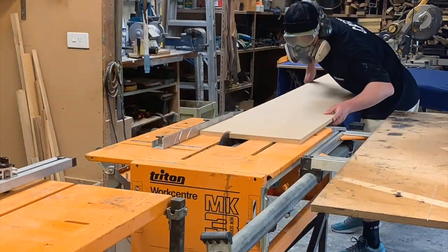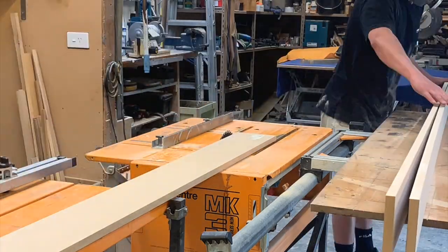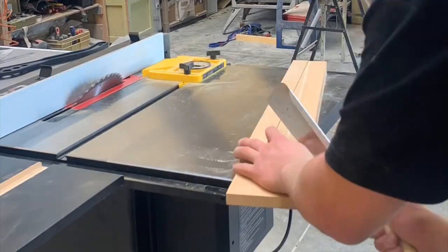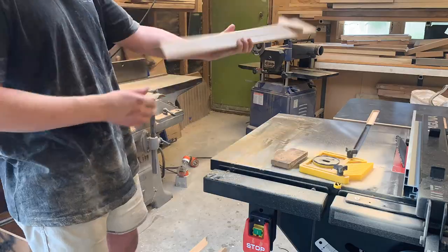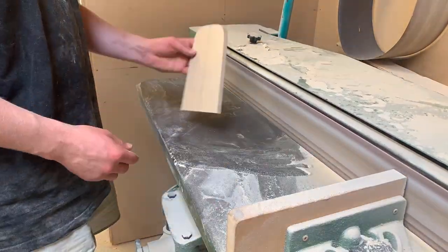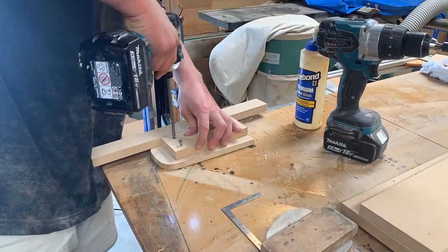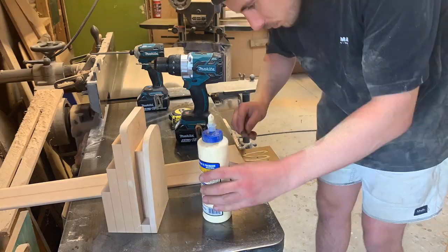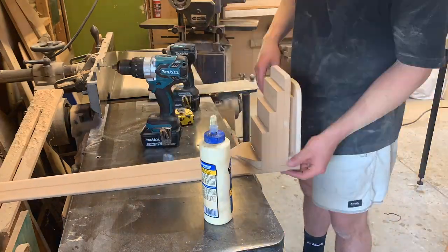To start this project I had to make a full-size prototype of the dining table leg, which is going to be used by the foundry to make their molds. I started by making the main body of the leg, then made both the top and bottom pieces which will sandwich the tabletop and form the final joint between the leg and the top. I laminated rectangles of MDF together to give me the material to grind away the curves I want on the underside of the leg.